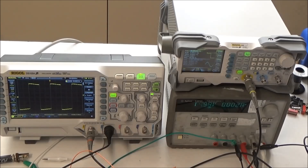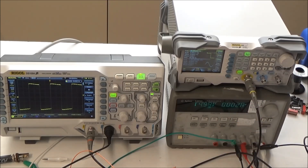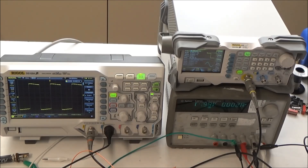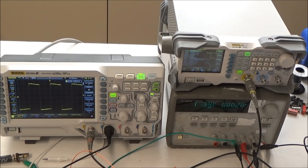So this is the basic setup. I've got a dual output power supply to provide the positive and negative power rails that the filter needs to run. I've got a function generator to serve as the oscillator that's going into the voltage-controlled filter. I can feed the filter a variety of different waveforms, shapes, frequencies, and duty cycles, and I can have it sweep frequencies too.